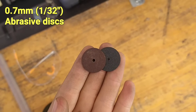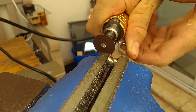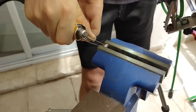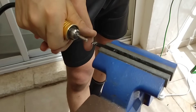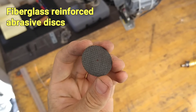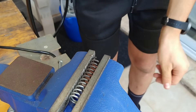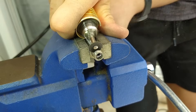There are several different cutting discs you can use with major differences. I find that abrasive discs tend to shatter instantly, and if they don't, they last less than a minute, so I end up replacing them more than actually cutting with them. On the other hand, fiberglass reinforced abrasive discs cut much faster, last longer, and are more resilient.